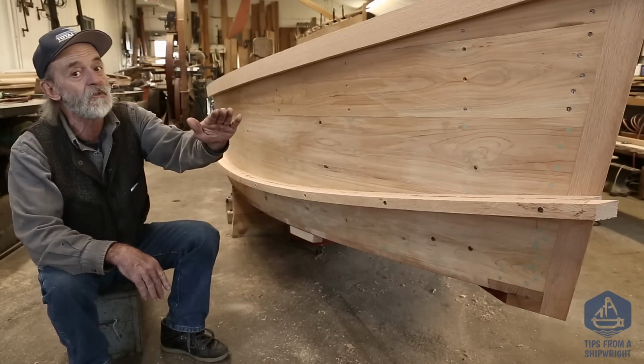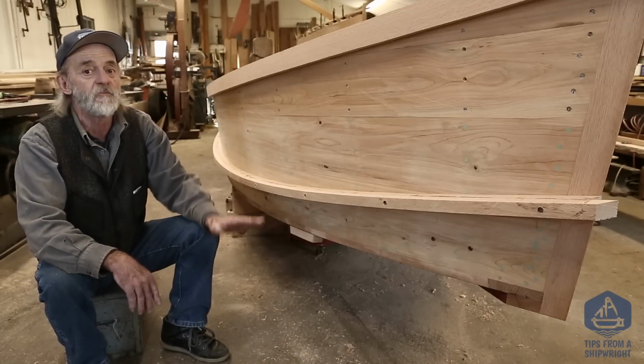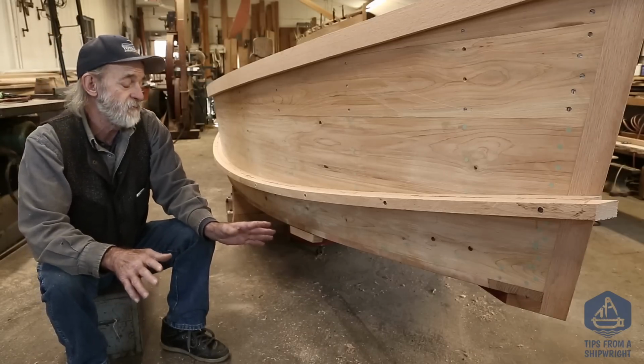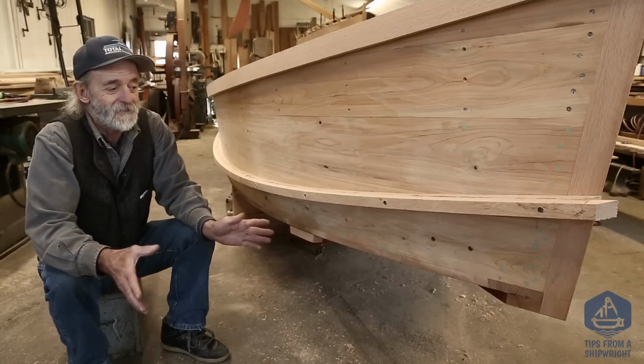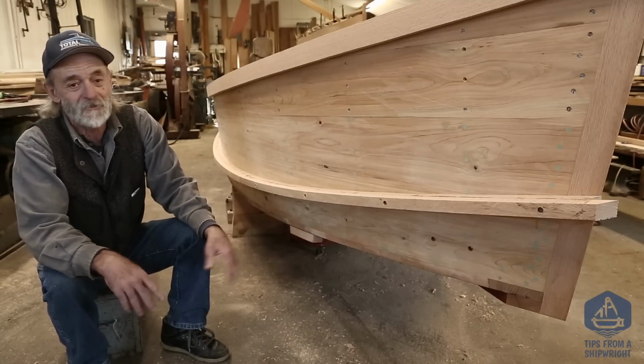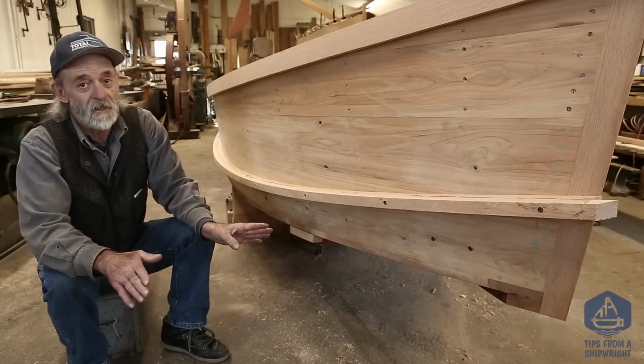It keeps the bow of the boat up so that it doesn't dive in and veer off to the port or starboard, and that's why I call them lift rails. Now, people call them spray rails, and I think that's kind of cool, but they may cause more spray than they cure, so I call them lift rails, and I know they are effective.